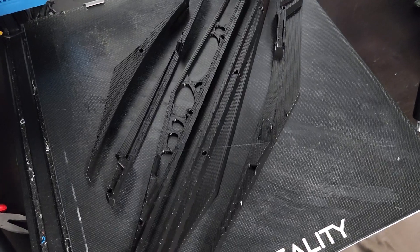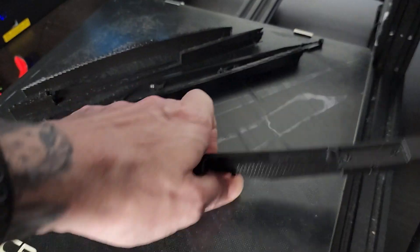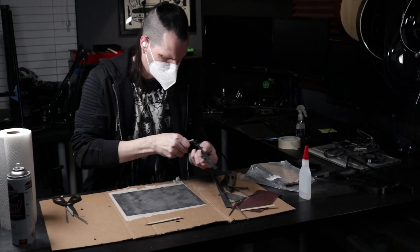Kind of like with the bottom part, there isn't so much structural integrity needed here because all of the guts of the guitar are going through the core. Still, it's sturdy enough that it's not going to feel like it's flexing. A point of contention for 3D printing is that you constantly have to deal with layer lines and the remnants of 3D printed supports. Knowing that this has a bunch of flat surfaces that are going to have to be sanded to a complete mirror finish, I split up the model so I can have all those flat surfaces print completely flat on the bed of the 3D printer. It's definitely going to give me a better finish in the end, but it's also going to require that I do a bunch of sanding and gluing.